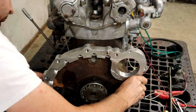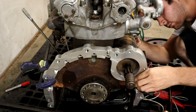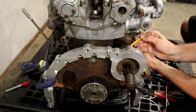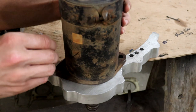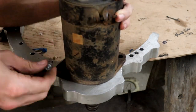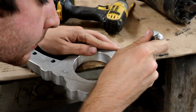Now that I've got the center bore machined out, I can line it up on the engine and also line up the starter. I'm rotating the starter to a position where the mounting holes line up nicely, marking the position so I can remember where it is. You can see it's rotated slightly from where the two original holes were — that's just so it lines up better where there's more material on this adapter plate.